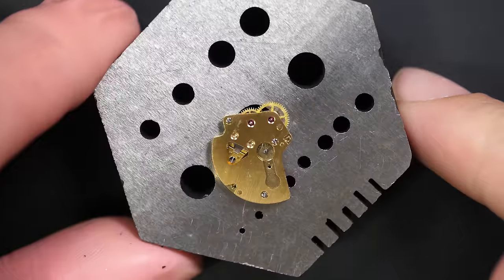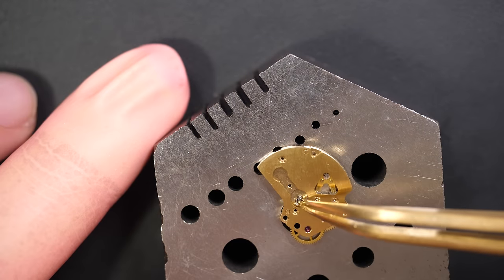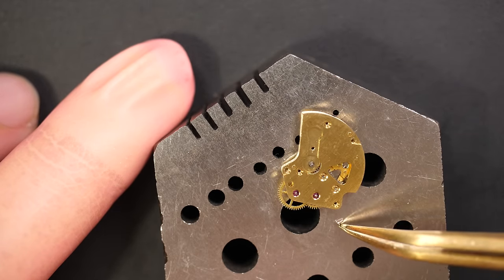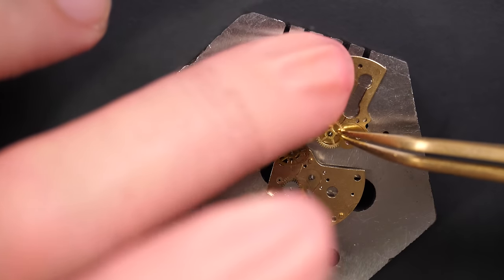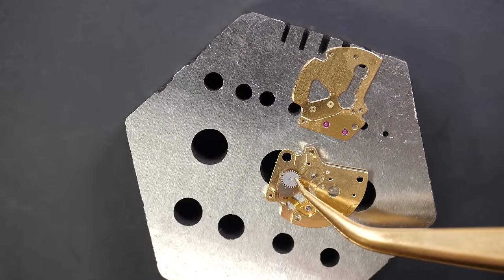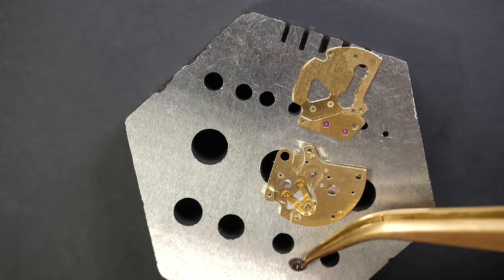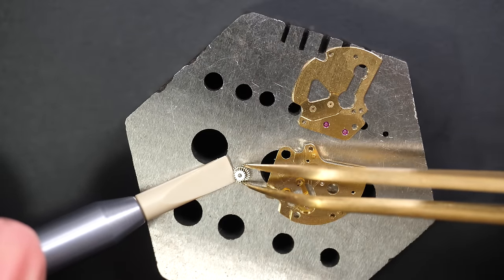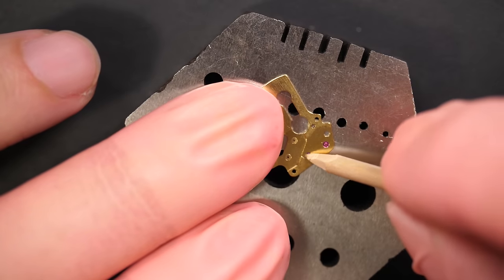One more thing to disassemble — the sub-assembly for the winding system. I remove the three screws there and underneath there are a few wheels. There's one screw here and another hiding under the plate. Removing this plate, the wheels are underneath. There's some dried-up oil or grease holding the wheels. Here's the big one and two wheels that were on a spring. It's a kind of reversing wheel — a bit different, I've never seen that before. It makes sense though: you have two wheels on top of each other like a clutch, and then the winding pinion. They come apart in two pieces. We disassemble them to make sure they get cleaned very well.